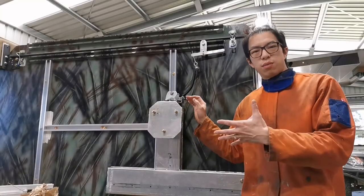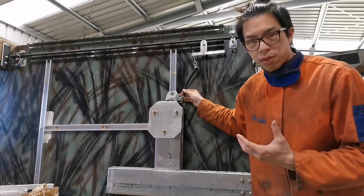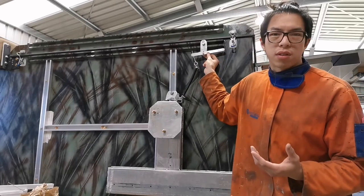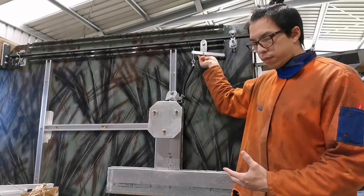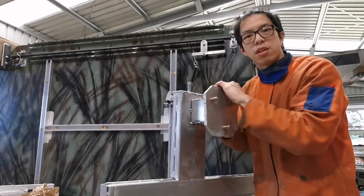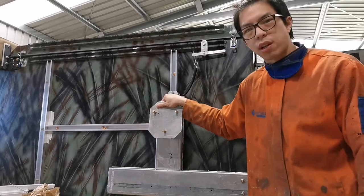I present to you this rotary latch mechanism on a spare wheel carrier. It's actually controlled by a cable, and in my case it's a stainless steel cable connected to this lever. And the lever at the moment is a bit loose. I'm going to put a spring to tension it up so it doesn't rattle around. Now, all it is, as I tension this lever or cable with a bit of weight on here, it just releases it. And as I slam it back on, it catches the carrier and it won't let go.